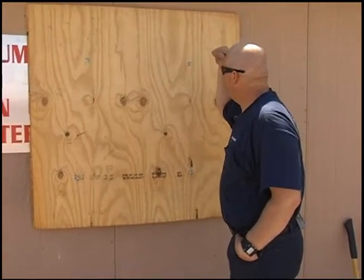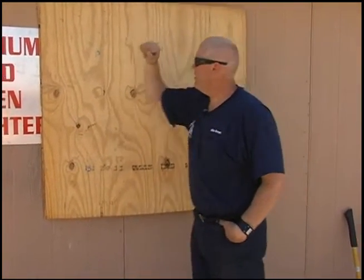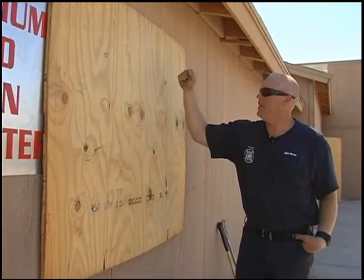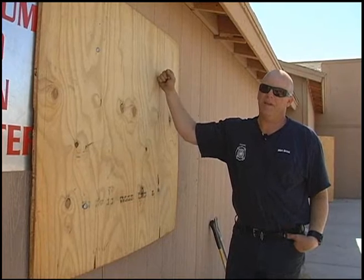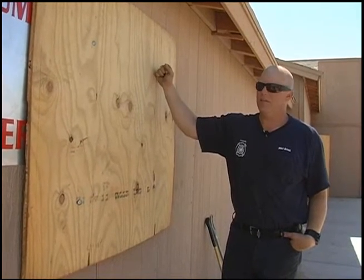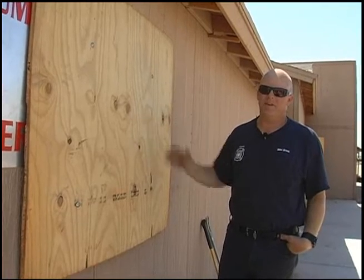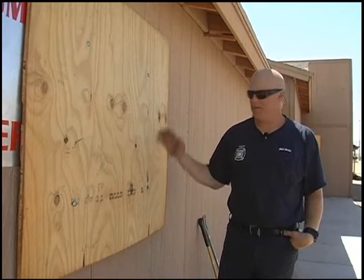The easiest way, sledgehammer the head of your lag bolts. You really have to hit it pretty hard, and especially if the wood is wet, it's really gonna be a lot harder than you think it is. So just be aware of that. If you got 5, 6, 7 windows to do, you're gonna be a little bit worn out after several windows.